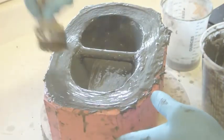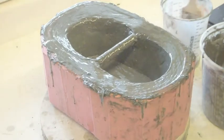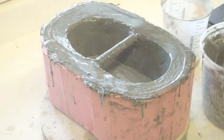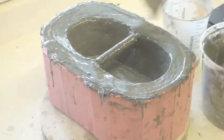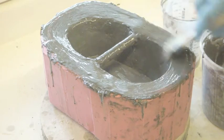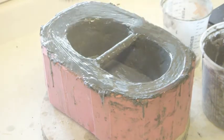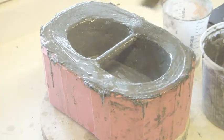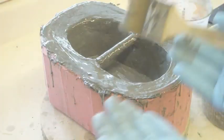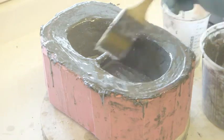So that's roughly an inch thick, which is a nice amount if you're wanting to run foam in it, because the foam will bake evenly. You've not got a part that's too thick, and it'll allow the heat to get in and bake out this way. If you're going to be doing encapsulated silicone, it's nice because it's nice and strong. So you're not going to find that your material is warping, which can be a problem with 1630. Typically in a dish formation like this, where it's even all the way around, so it's a perfect semi-sphere, especially with the handle, I get minimal warping.